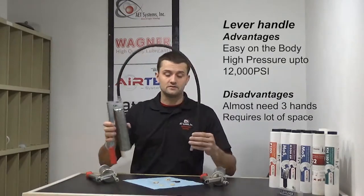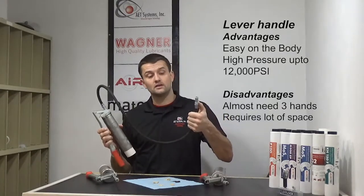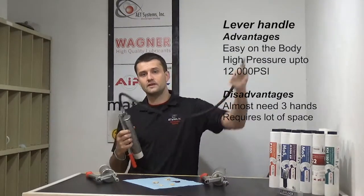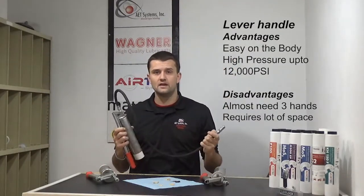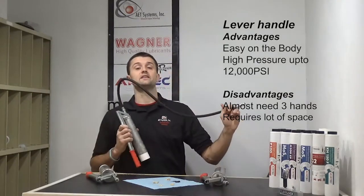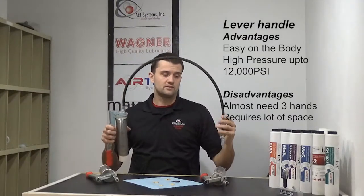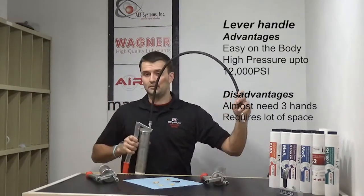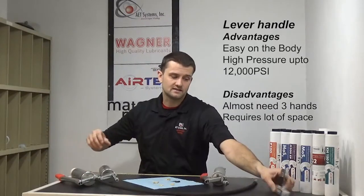You can look at different options within this grease gun, one of them being a flexible hose. If you've got a strong four-jaw coupler or a locking coupler on the end, it makes it pretty ideal. You can lock onto the zerk fitting and reach up to different zerk fittings that might normally be out of reach of a rigid tube. On truck components, if you've got to get in to grease your suspension, you can get that hose in or around. This really becomes functional when you have a locking coupler, because otherwise you almost need three hands — you've got to pinch the grease gun somewhere so you can work the handle while you hold the coupler on the zerk fitting.